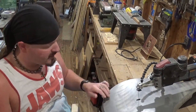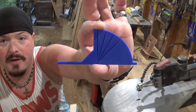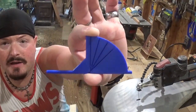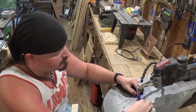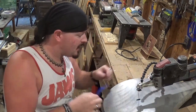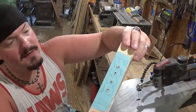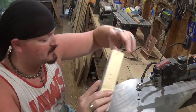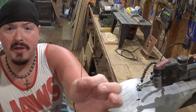It is essential when compound cutting that your blade is square to the table at a perfect 90 degrees. I've already checked it with the gauge underneath the table, but I also have this nice tool I printed on my 3D printer — a blade leveling guide. You can see where the blade goes in for common angles and of course the perfect 90-degree angle. I'm going to line it up — looks good both ways. Really handy tool found on Thingiverse. This is a Steve Good design. I'll show you how to cut a few internal cuts and then move to the final outside cuts.